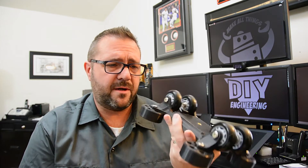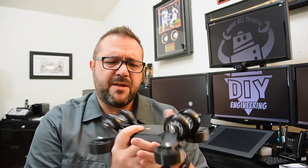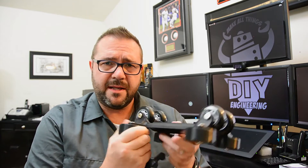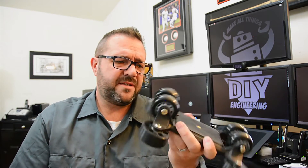But if you're making a practical part — something like this camera slider for a dolly — there's specific form, fit, and function that I need it to behave well in. For me, it needs to be rigid, have a rigid body, but these wheels need to be rubbery and able to grab the surface. It needs to be strong in these corners, so it needs both good design and strong materials.